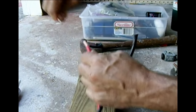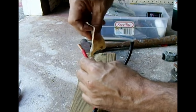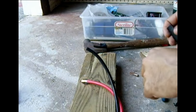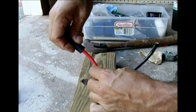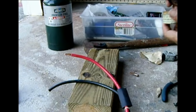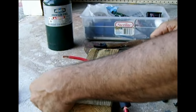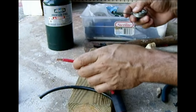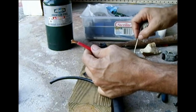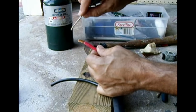Just get a little bit of sandpaper to shine up the wire. Before we solder this, we're going to slide some heat shrink over the wire, all the way down away from the heat. We're going to be using a propane torch. Regular plumbing flux is fine; rosin core is even better if you have it laying around — as long as it's not an acid core. Just coat the wire nicely. Once this is heated, it will clean the copper and allow the solder to flow nicely.